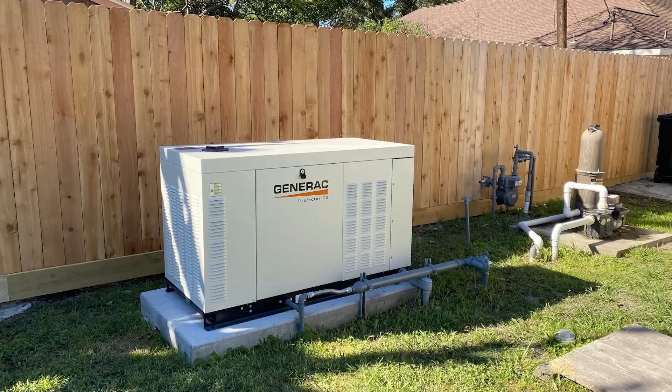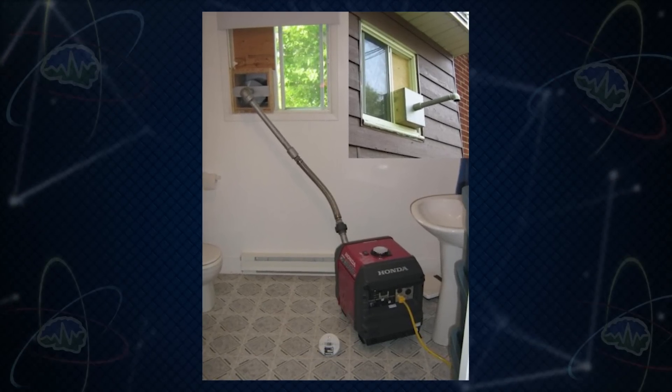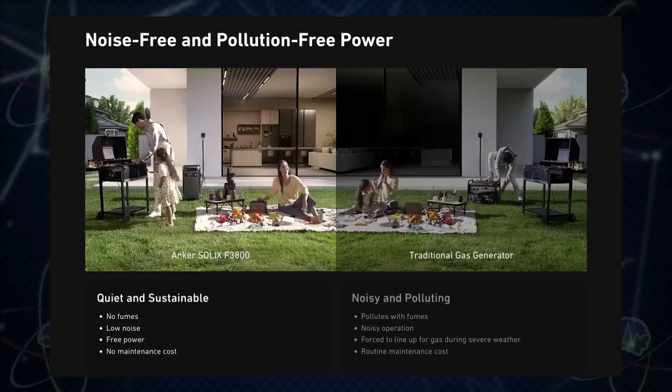A lot of people say you can do all of this with a gas generator, but you can't hook up solar panels to a gas generator. One big problem with gas generators is people forget about them for a couple of seasons, and then in the middle of a cold winter night when you need it, it won't start because it hasn't been maintained — stuff got gummed up, or you don't have enough gasoline. High-tech whole-home generators have to turn on every month for maintenance tests. They're loud and require a yearly maintenance contract. And they can kill you — carbon monoxide builds up if people put them in their garage or basement where they shouldn't.